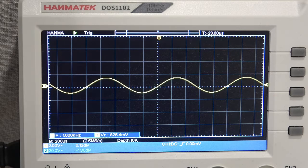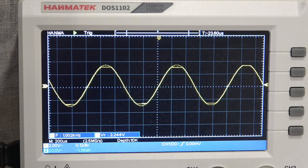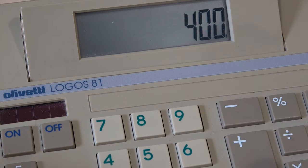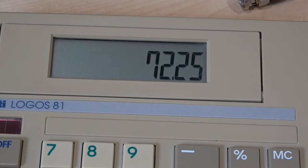Here is our 1kHz sine wave. We're going to turn the gain up until we hit clipping. Looking at the meter - we're on the three-volt scale times ten, so that gives us 20 volts. 20 times 20 divided by 8 equals 50 watts across 8 ohms. I've then done the same test for 4 ohms in exactly the same way and we end up with 72.25 watts across 4 ohms - pretty good really.